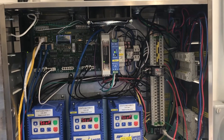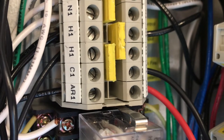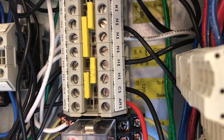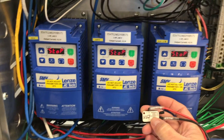The next step is to locate C1 and AR1 terminals in the control package. These are the terminals where the wires from the microswitch are going to land. Next, wire from terminal C1 to the common terminal on the microswitch and then from the normally closed terminal on the microswitch back to the AR1 terminal.